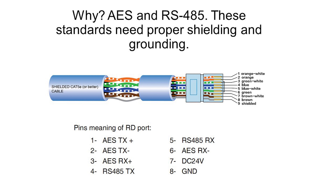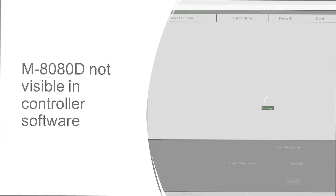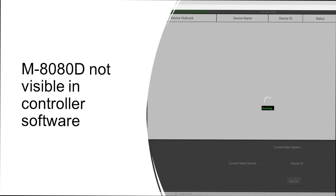This is why in some test cases we see that shorter unshielded CAT5E cable can work, but they are unreliable as the distance increases. If you ever have this issue, we suggest checking your cabling and terminations for proper grounding.